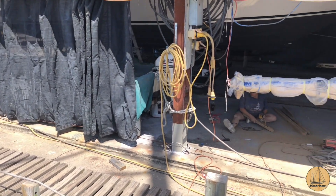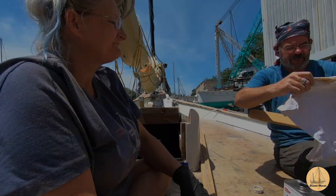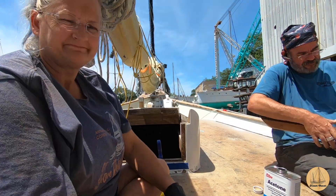Deb continues sanding in the shade. We've been making a lot of progress today — we got up at 5:15, were out of the house by 5:40, down at the boat around 6:35, then ran to West Marine to get parts after measuring and marking the rails and pulling the companionway slides off. We were at West Marine by about 9:55. Now we're going to get these rails bedded, grab a quick bite to eat, and by the time we get back the sealant should be cured enough to set the bronze strips and the hatch. With the rails sanded and surface prepared, we wipe everything down with acetone to ensure no oil or remnants remain so we get good adhesion.